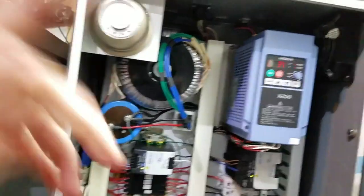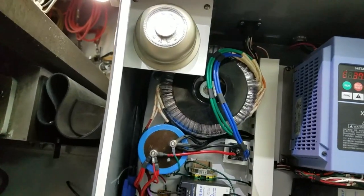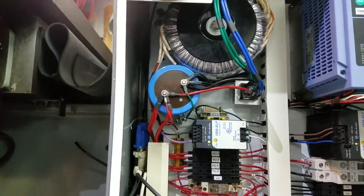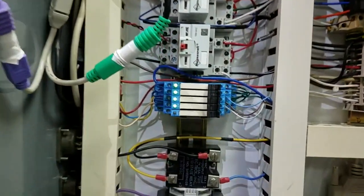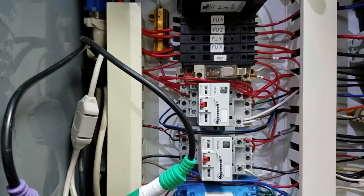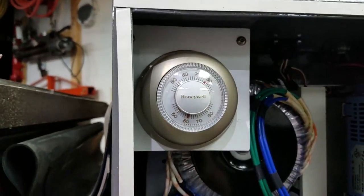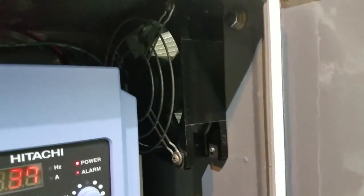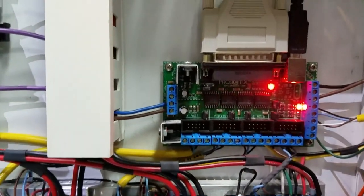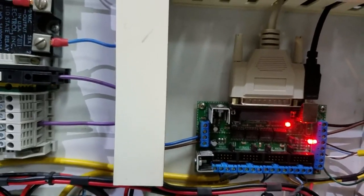The rest of the enclosure is tremendously simple: a frequency drive for the spindle motor, a large toroid with a filter capacitor for the DC power for the servo drives, an Allen-Bradley 5-volt power supply for all the 5-volt electronics including the encoders, a couple of solid-state relays for reading signals from the home and limit switches, two ganged-together contactors which are large relays for the master e-stop, and a Honeywell thermostat for controlling the enclosure fan. The breakout board is made by a company called Probotics, which takes signals from the parallel port on the computer, buffers them, and relays those signals off to the Gecko drives.